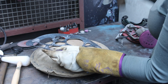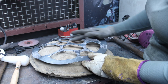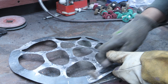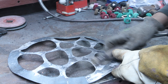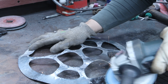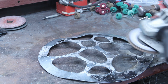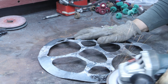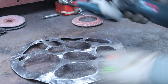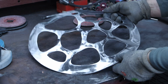There was a thick layer of oxide over it, so I took my usual abrasive wheels but they weren't getting through, so I shifted to my blender. Even that didn't remove all the layers, so I switched to a flap disc — much more efficient — but it was more aggressive and left marks behind. I had to switch back to the blender to smooth up and remove the previous lines, and it started to look better.